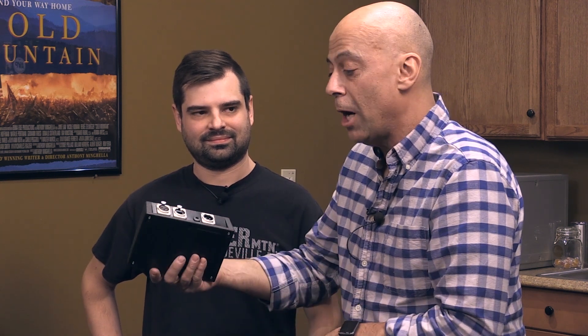Here's what I love about this: if you want to do this yourself, put this baby in the booth. There is no wiring involved. You take your console, go into DMX in, and take DMX out to the rest of everything that already exists. Cat5 is already installed. Our satellite stations are slaves — they use Cat5 and they daisy chain. You don't need to know how to wire DMX or terminate Cat5s or do anything. You get this, it's a turnkey solution.